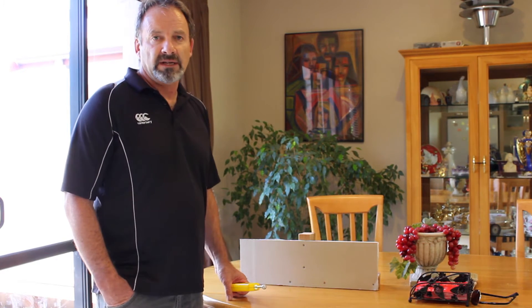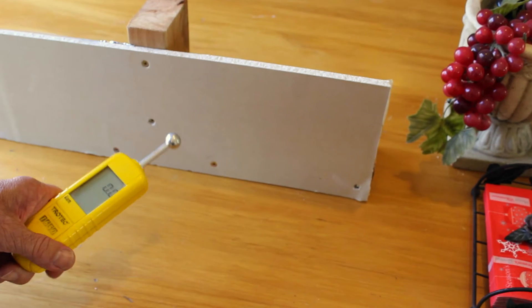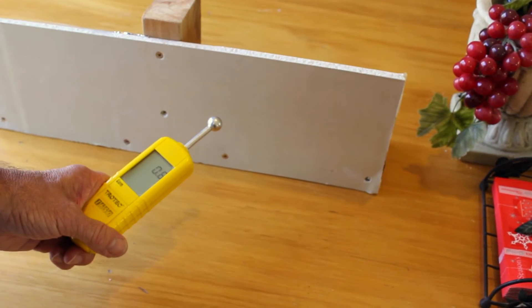Gib bracing sheets will do the same thing — it's a high-density material so you'll get higher readings of about 10 digits. In those instances you have to raise your acceptable level, basically from 45 to 55.